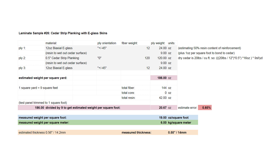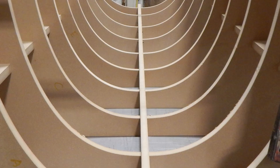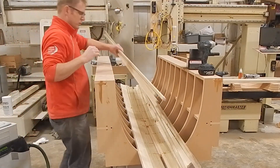This is an interesting one because the cedar acts like a core, but also like a very thick, very low density lamina in the middle ply. And because strip planking is just strips of wood covered in fiberglass in most cases, it lets you build complicated shapes pretty easily and without a tool.